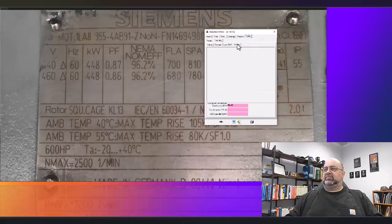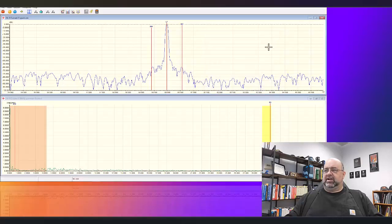That's with losses associated with some of the other things behind there, unbalanced losses and the like. There's a little bit of unbalance there. But in any case, that is one of the primary concerns, and we're running into this a fair amount. We'll see it in bad bearings. This one in particular, both bearings, across the very short time it's been running, are now showing indications of failure.